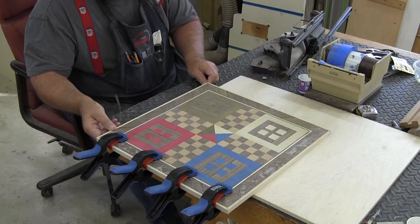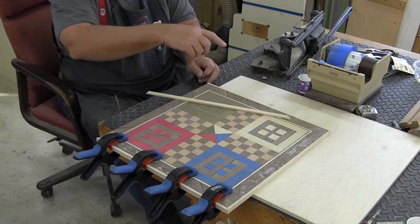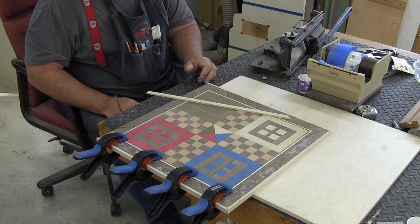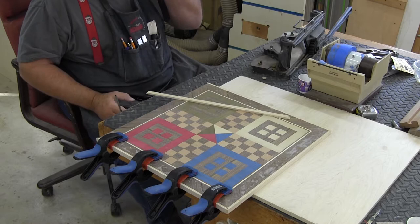So now this edge — I'm working my way around this board. I'll pin nail this and then use these clamps to make sure it's got some good clamping pressure. After 10 or 15 minutes it's safe to remove the clamps. So I'm going to do that now, and then I'm going to apply the glue and show you the technique I go through for doing that. It's not rocket science, but you might find it helpful and interesting.